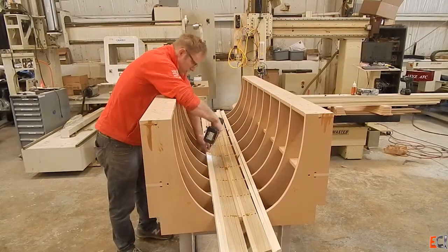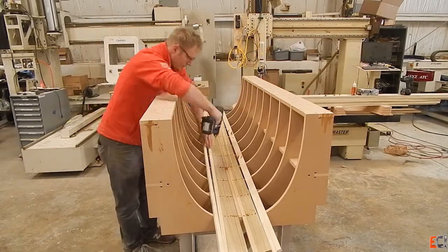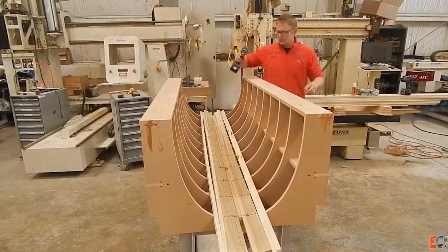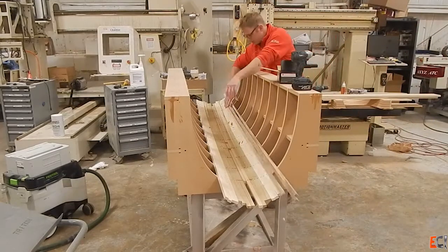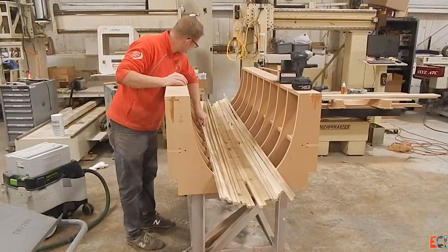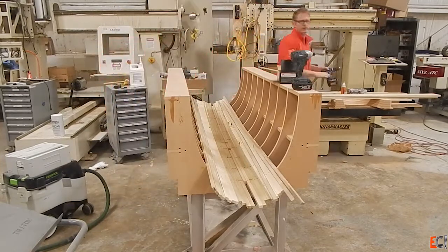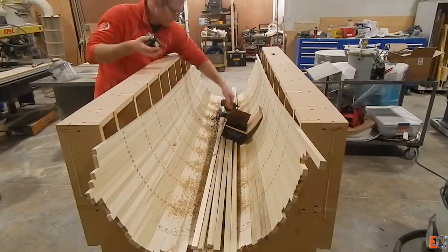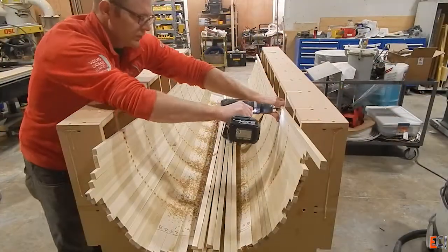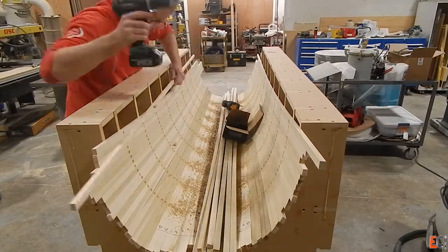There were a lot of strips. Now I'm laying them into the completed egg crate. This was slow going — probably took me four or five hours to strip plank the whole thing. You can see the centerline rib is the same height as the strips and it stuck up and became sort of a guide. The strips laid in nicely. They were three quarters of an inch wide and I screwed each one in at every point where it crossed a frame.